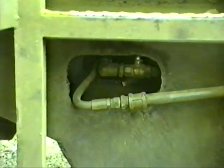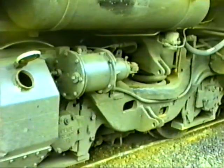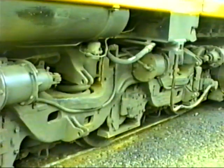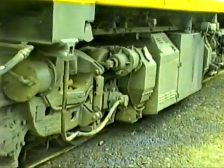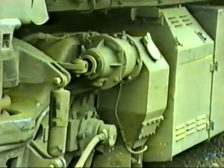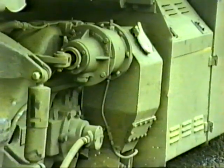The sandbox — there are four of these to each bogey. The locomotive has three axles per bogey with a traction motor on each axle. Here you see the other sandbox at the opposite end of the bogey. Here we see the magnet valves for the sand, which are located below the running board, and above that is an isolating cock for the sand air supply.